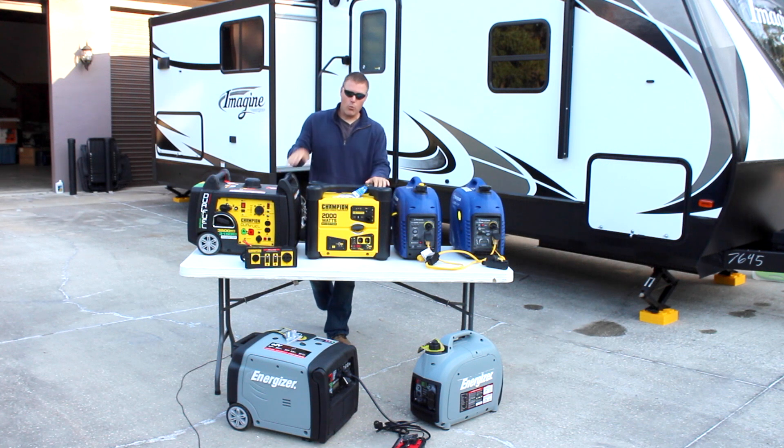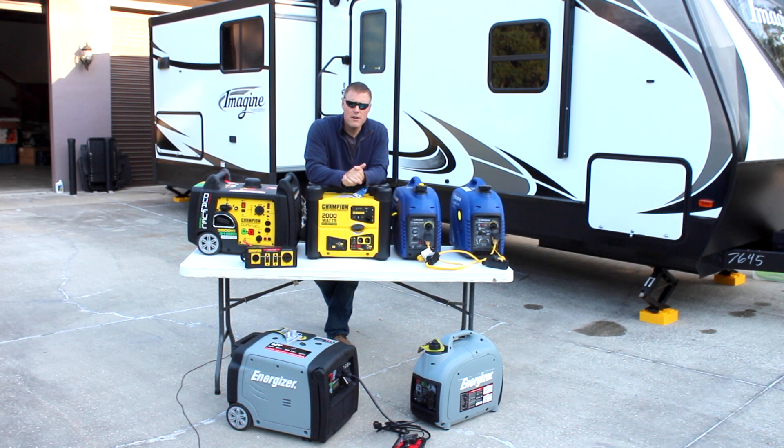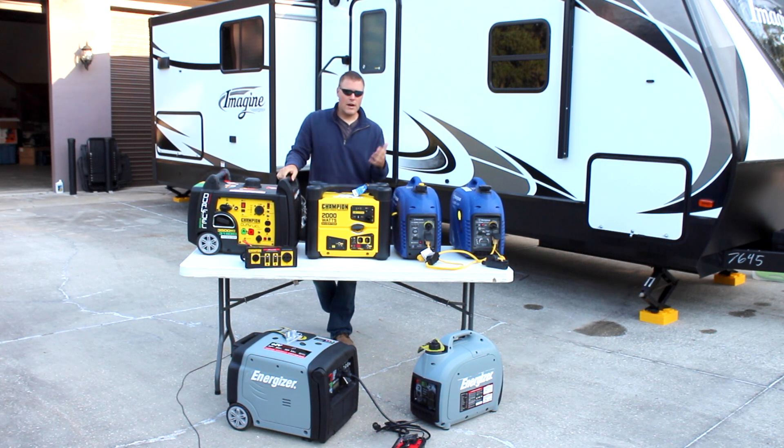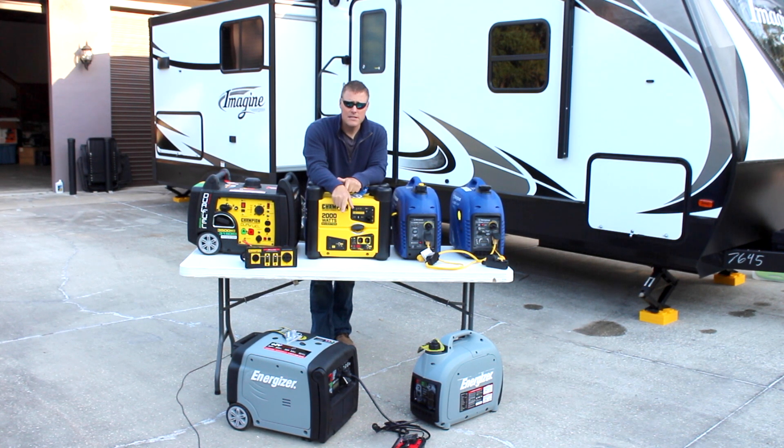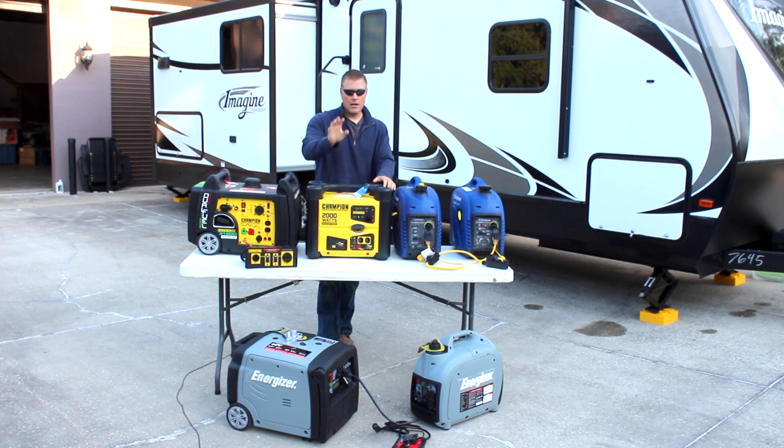In my opinion the best setup is to have one 3,000 watt generator like this Energizer, or the 4,500 watt Westinghouse with push button start, and the ability to hook up a 2,000 watt or another 3,200 watt like this Energizer, coming out to a 50 amp cord. That is the best case scenario — but of course it costs more money. There is no right solution for everyone. It comes down to how much power you need and how important push button start is. Two 2,000 watt generators can be picked up for roughly $1,000, while the Energizer set in front of me is close to $2,000 — but you're getting significantly more power, a 50 amp receptacle, and push button start.